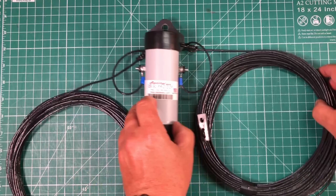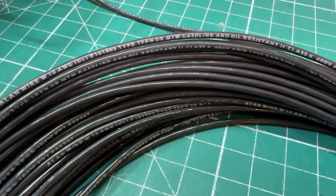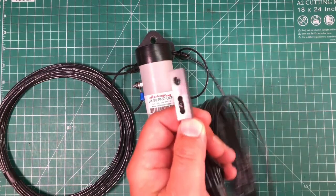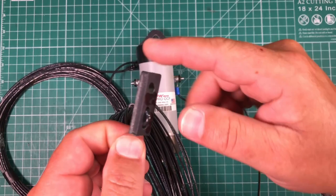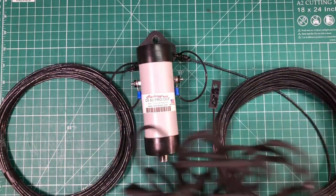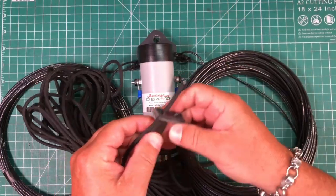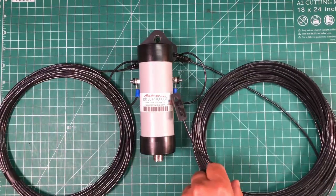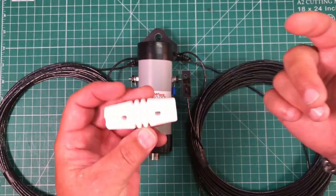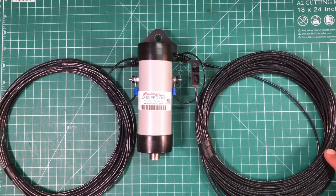The wire itself — very nice wire. Not polystealth, but I've not seen this type of wire before. It's 16 gauge and it's gasoline and oil resistant. It feels quite nice. The only thing I'm not too keen about are these little end insulators — it's just some plastic and it's just wrapped in there once. I wish there were three spots for strain relief. I was also concerned about whether the holes would be big enough to fit my paracord, and sure enough, it is. I'm going to put this up in its stock configuration, but I do have some alternative insulators I picked up at a hamfest I could swap in if needed.